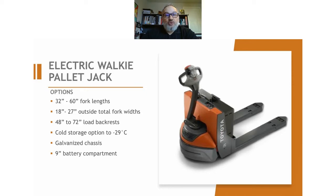The 9-inch battery compartment allows you to put in a bigger battery pack if you need longer run times between charges. The packs you'll generally see on something like this are four 6-volt batteries wired in series to make a 24-volt system. They typically have an onboard charger with a 110-volt plug-in, so you can pretty much plug in anywhere in the warehouse. The charger is an opportunity charger — you can charge as you need it. You're going to have a flooded lead acid battery, which is the least expensive way to go.